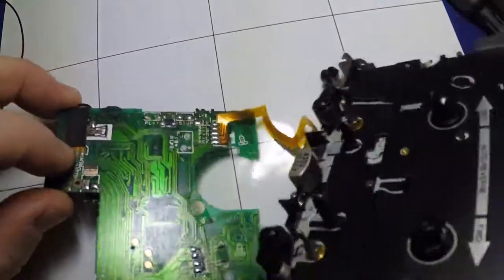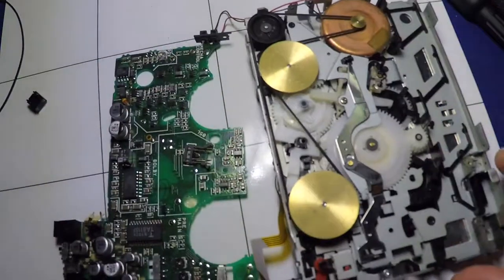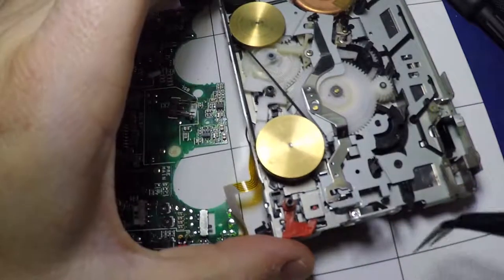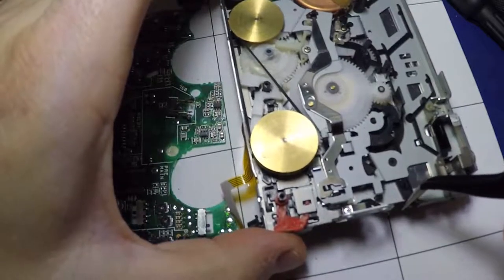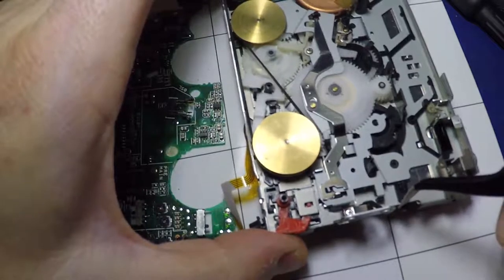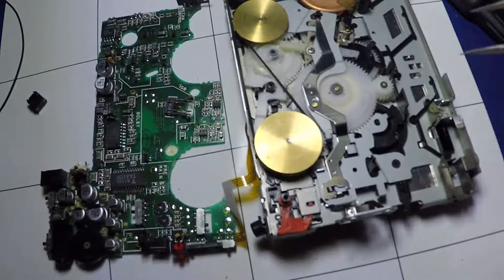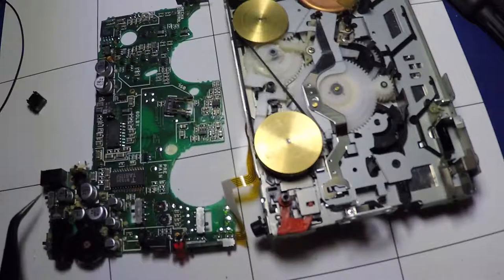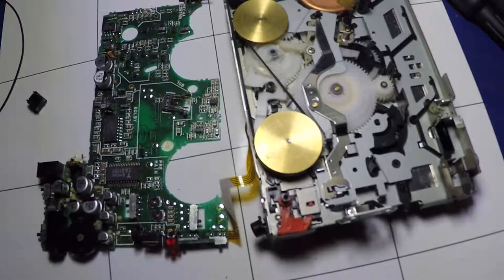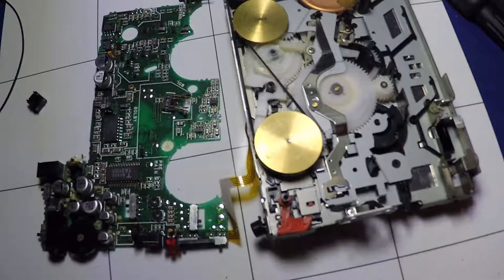There are a few switches on the side. One of the switches is actually here and it's mechanical, which deals with forward and rewind. You can either jog it partially and then it'll spring back, or you can push it all the way over and it will continue forward or reverse whichever it's going. You then have two switches here and two at the side. Those deal with various functions: dynamic loudness, remote, and on the side we have Dolby and Type Selector. That's what these are all about.